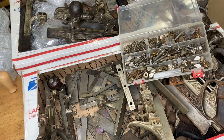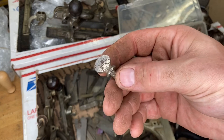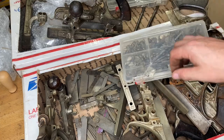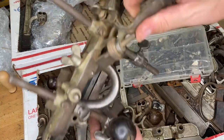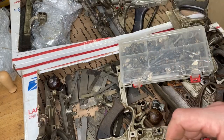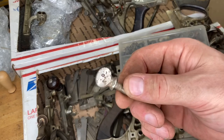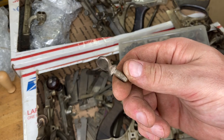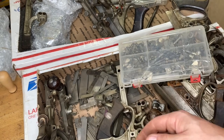In the third box there are a bunch of short rods and long rods in addition to the ones I already have in stock. The short ones always seem to be the ones most frequently missing. Here's a shoulder screw — on your 45 this goes to your slitter and slitter depth stop. Incidentally, the same shoulder screw is used on the 55 for its slitter and slitter depth stop, and also on the tower assembly. These sell for as high as 18 to 20 dollars on eBay; I try to keep mine in the 10 to 15 dollar range.